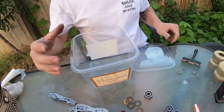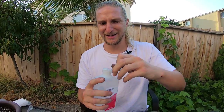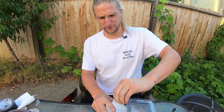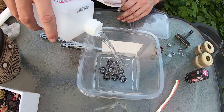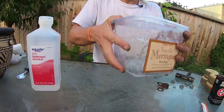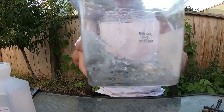Now we're going to put our bearings in the container. Then we're going to pour our cleaning agent in. You might want to wear gloves and eye protection — always be safe, chemicals are no joke. Pour it in carefully, no splashing. Get them nice and submerged. A smaller container is actually better because you want to use as little chemical as possible. We can let it sit and shake things up a bit to help get the chemicals spreading around the ball bearings. Let this soak for half an hour to an hour, or even longer.